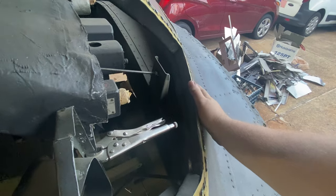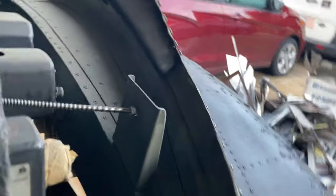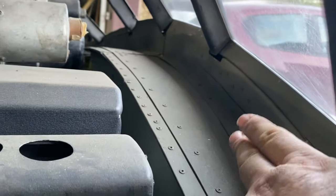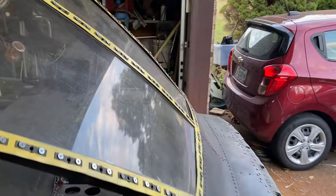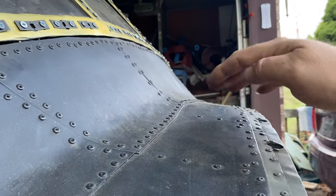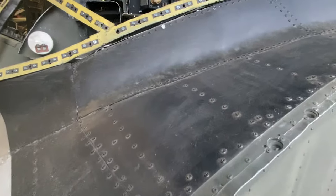When I first started building the actual airframe, the first thing I made was bulkhead 1.1, which sits right there. Above bulkhead 1.0 is that big three-inch area going up, and I thought the frames attached directly to this frame — but here's how they actually attach: the canopy frames continue all the way down and are thread-fastened into these stringers, identically to how it's found in the aft section.